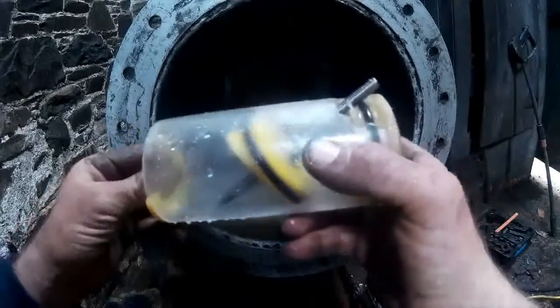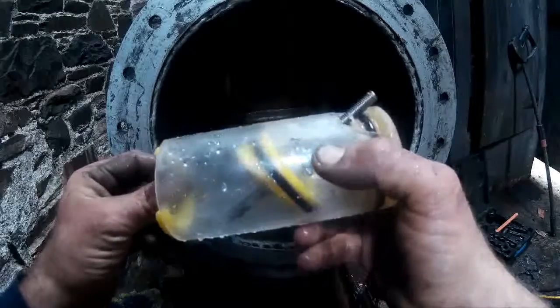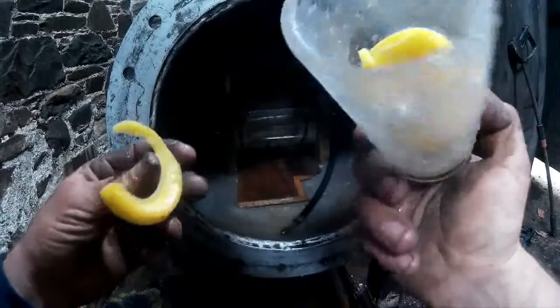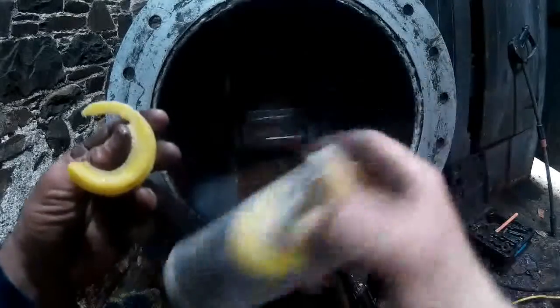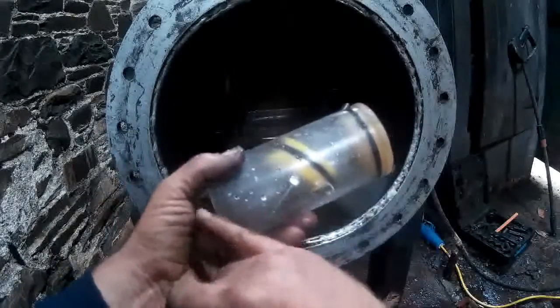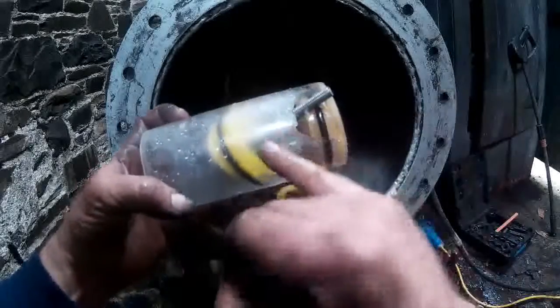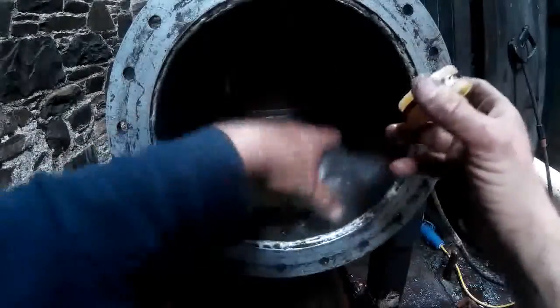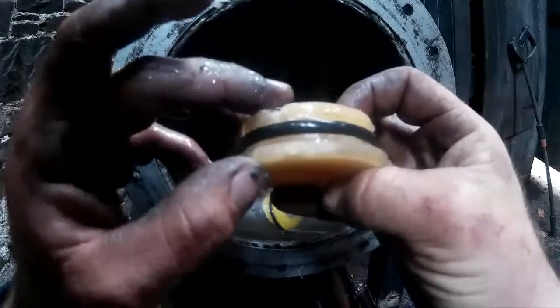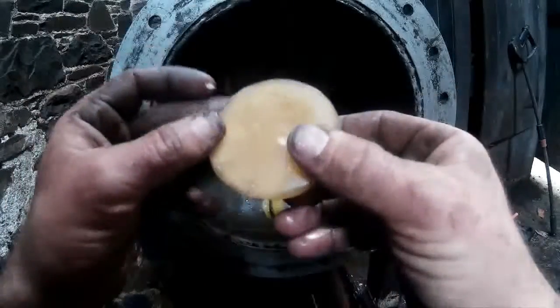low density polyethylene melted down chopping board was good to about 200 meters, and then the plastics failed quite uniformly. It's not got layers or anything in it, and then it's been squashed into the tube so far, and then this piece of rod has punctured the acrylic on the other side and failed at the other side as well. Kind of made a ding in this end cap, but that end cap was good to 200.